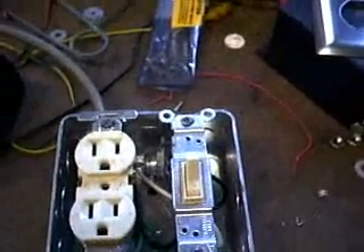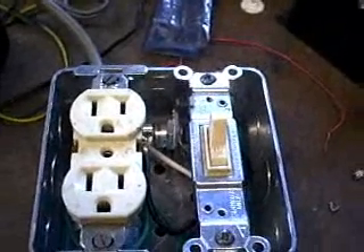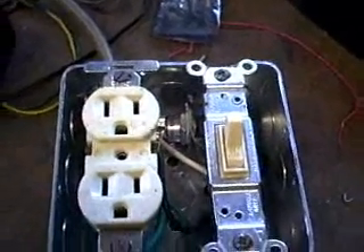So I'm pulling it apart and putting in all new insulators, hopefully to create a condition where it's isolated from ground. I also forgot to mention earlier that the reason for that bracket mounting to the box the way I did is that it's mounted with heat sink thermal compound to draw away any excess heat and let the box itself be the dissipator or the heat sink for the rectifier.